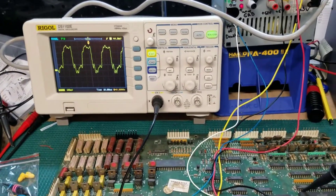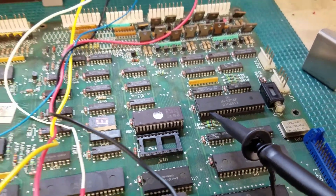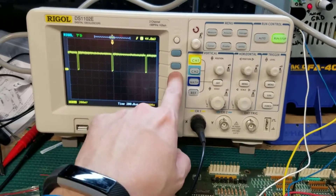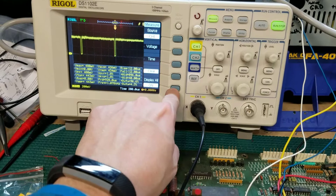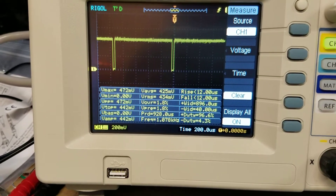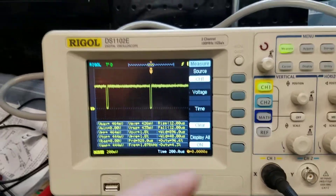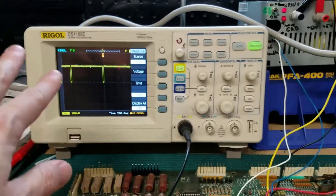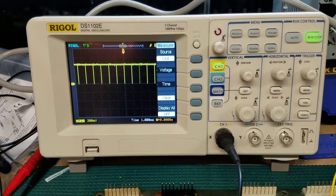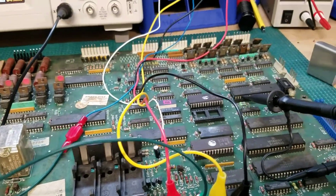Here's our second example, again connected to the 6808, this time looking at the IRQ. We're looking for consistency here. We've got our IRQ signal listed appropriately. We can go into the menu and display all our key measurement points. We see a min-max of zero to looks like eight millivolts from that side. I may not necessarily understand all those numbers at this moment, but I'm able to look in here and see consistency of what I should see within the IRQ signal — another great place to test what's going on from a board perspective.